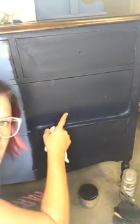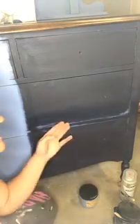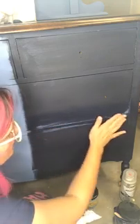Or if your sealer is really good and it won't, then you could take sandpaper to it to get to the wood. But with wet distressing, like I said, a lot of people use it because then you don't have all the sand particles in the air, and it just shows more dimension on a piece. So that is the wet distressing. And then I'm going to show you dry brushing really quick because this will add another dimension to your piece.